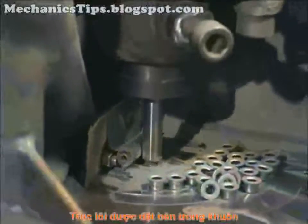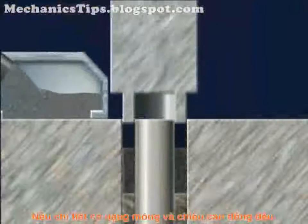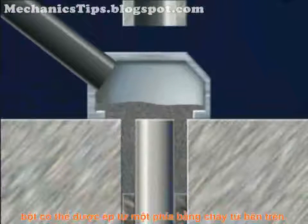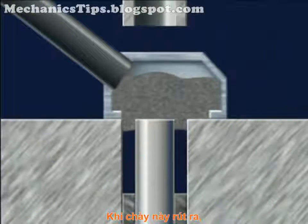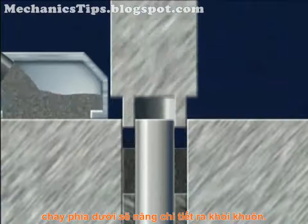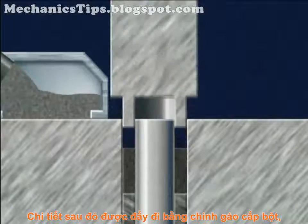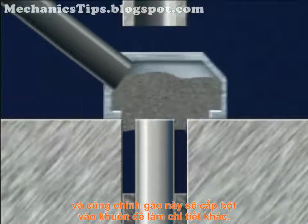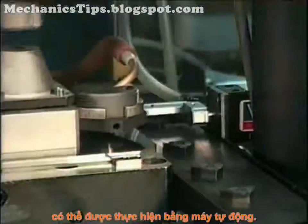Core rods are used inside the part of the die to control formation of holes parallel to the direction of pressing. If the part being made is thin and uniform in height, the powder can be pressed from one side by the upper punch. When that punch withdraws, a lower punch raises the part out of the die. The part is then ejected by the wiping action of the powder feed chute, which also wipes powder for the next piece into the die. Ejection from the press can also be accomplished using automated handling equipment.